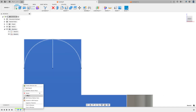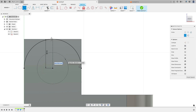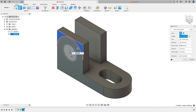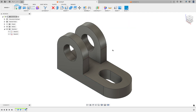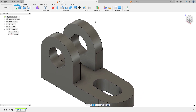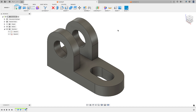He also drew a circle at the center with a diameter of 24, finished the sketch, then extruded the different regions pulling them all through — distance set to All. On mine I made sure to add the tangent constraint, so I don't get the little flats you might see on his version. If you look closely, his two arcs aren't quite the right radius and tangent, and he gets a tiny flat across the top. Anyway, that's his version of the part basically done.